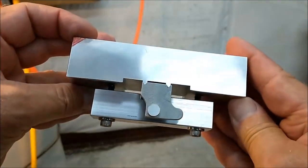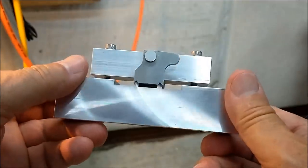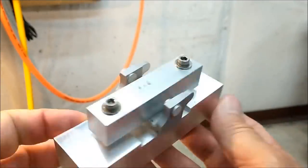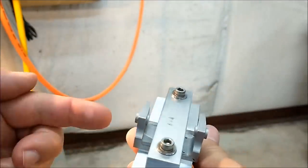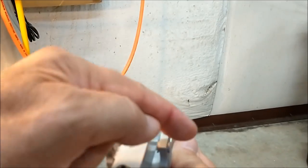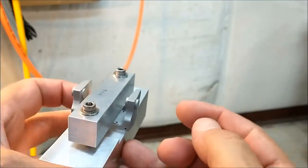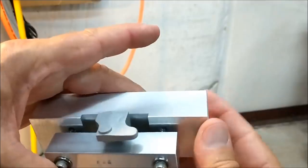That is the plan right from the get-go. We are sitting on the notches the way the tailstock was positioned. We're actually drilling it from the gear cluster side back. This is the back gear lug. So this is the gap between the casting and the face of the tailstock right here. So we are in line the same way the tailstock was.